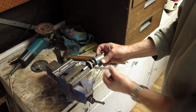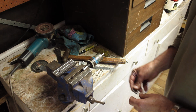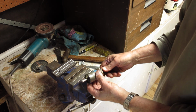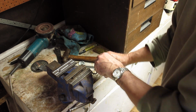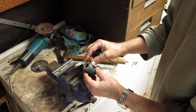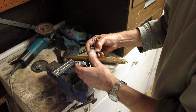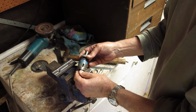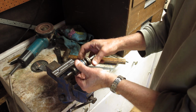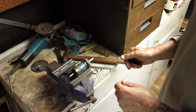That's going to cut us a bigger diameter than we really need, but better too big than too small. We can always make it a bit smaller. Okay, so there's our hole saw mounted on the arbor. Now, the larger diameter hole saws use these pins to locate and lock against the tool. If you just drive it all the way down hard against the arbor, it'll be harder to get off the arbor because it'll lock on very strong. But it means that it's much more rigid. So I'm not going to engage these pins, I'm just going to put it on the arbor like that. I'll fight with that with some multi-grips after the event.